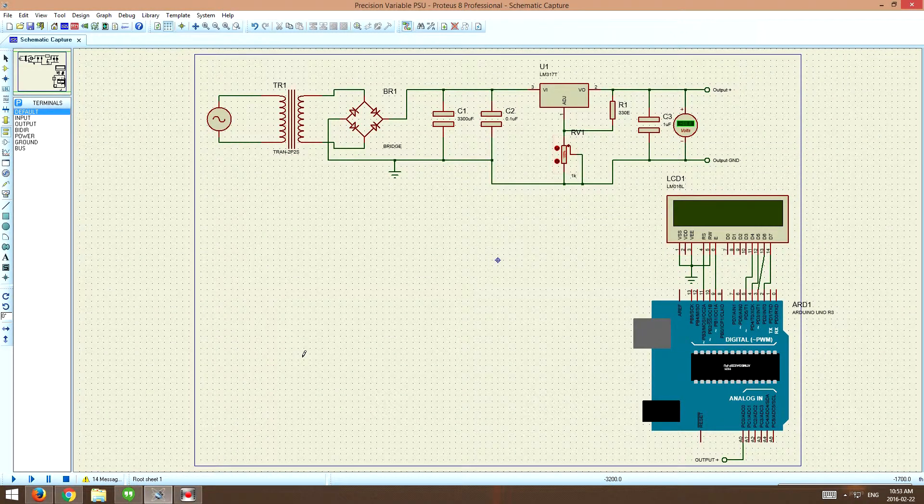At the moment we've got the pot turned all the way to the minimum. We're going to power it up on the simulation — and there you go. This is an actual inline voltmeter I've connected over here so we can see the real voltage out of the simulation, and this is the reading from the Arduino. With zero to five volts you can read up to five volts directly, so there's no need to get fancy with voltage dividers yet. As we step up the voltage on our variable power supply, you'll see the voltmeter and the Arduino-powered voltmeter reading exactly the same all the way through.